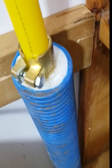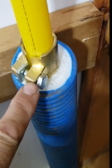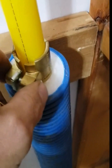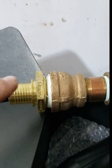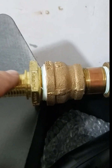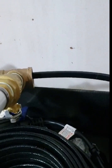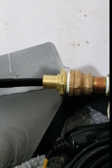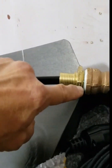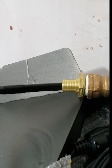This is the water line that we ran from the house to the pottery studio — an insulated water line with a jacket on the outside to protect it. This is a compression fitting over top of the tubing; it's going to compress the tubing on top of this barbed piece once we get it inserted into the tubing. I've already put the heat cable through the fittings and here it is protruding out of the barbed fitting. This end is going to go towards the house — we're going to push it through the water line to the house.